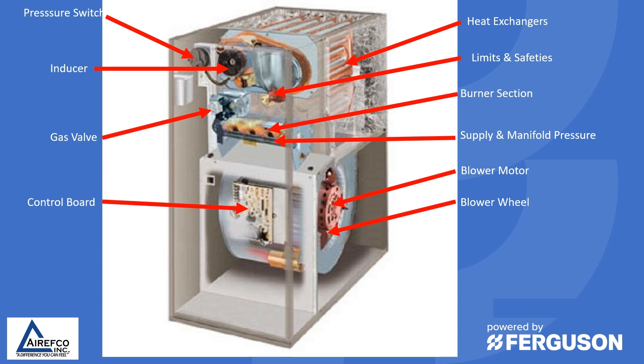The heat exchangers need to be examined on a regular basis — at least twice a year — to make sure there are no holes, cracks, rust, or corrosion that need to be addressed. The safety of the homeowners is at jeopardy here, and you as a technician need to make sure the heat exchangers are in good shape. Regarding the electrical: most furnaces need a good ground to operate. If you have control boards behaving in ways that don't make sense, it could very well be that you've lost your ground. Make sure you have a good ground to each one of these furnaces.